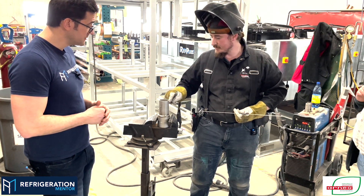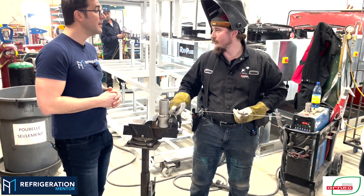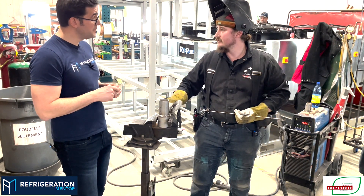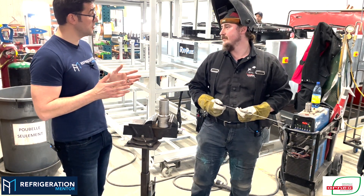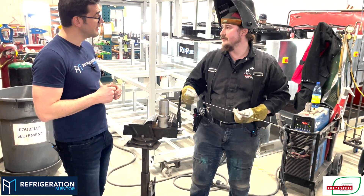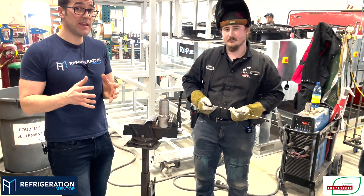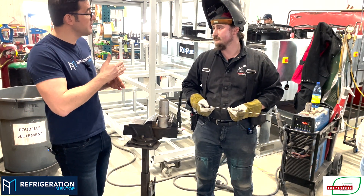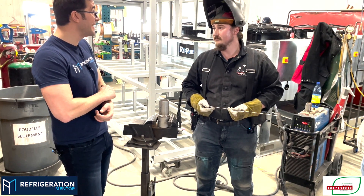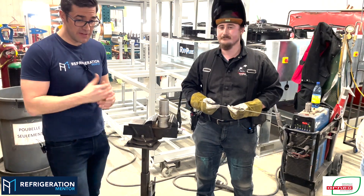Another thing I want to point out: I stop at this area here and I'm going to start my second weld a bit further along, so when I finish I go over the very first point — the point where I stopped on the first pass. That makes so much more sense because now you've got a full pass over it. Where you finished, the root pass underneath is full. That gives a kind of double protection, and there's a much better chance of not leaking.